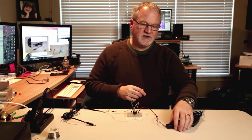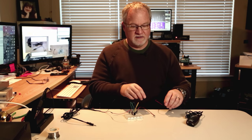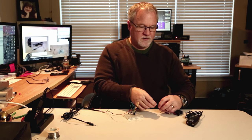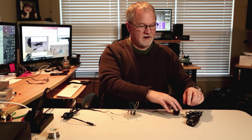So what I did next was I took a DB9 — just a shell of a DB9 — and I soldered a couple of wires to the ground, pin 5, and the data terminal ready line, which is pin 4 on a DB9. So I soldered those on, and I connected those wires. I used wires that had little female jumpers so that I could plug the male jumpers on my breadboard where I mocked up this circuit. And so the hot wire goes to the DTR line and ground goes to ground.